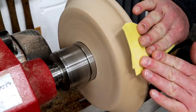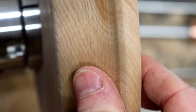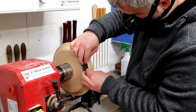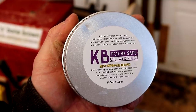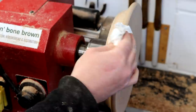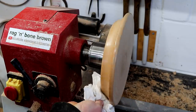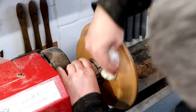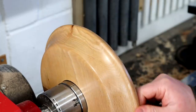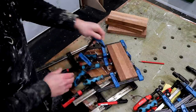Once I was happy with the shape I sanded at 120 and 180 grit and it was looking pretty smooth, so I did my final sanding at 240 grit. For finish I'm using my own homemade food safe oil wax finish which is available to buy on my Etsy store if you're interested — I'll leave a link in the description box below. It's a soft blend of mineral oil and pure beeswax and I can wipe it on with a paper towel.